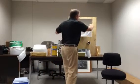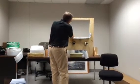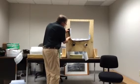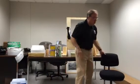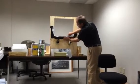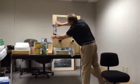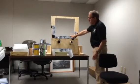And when I release the liner in the back, excuse my back to the camera, I go like so on this side, and then over here I run this across and then up. At this point, I come back and I pull this liner all the way across the opening, and then I pull this out. I release this rubberized material to adhere against the sheathing and the wall. So when I install my window, I don't have an issue with moisture coming in those locations. See where I'm at here? Then I take my razor or knife, I cut this relief, I'll pull it down, and I install my window. I don't have issues with moisture coming through, mold, rot, air infiltration around the bottom of the windows.